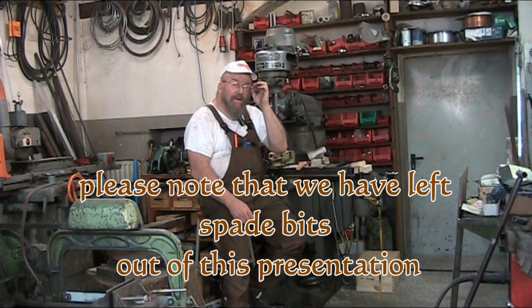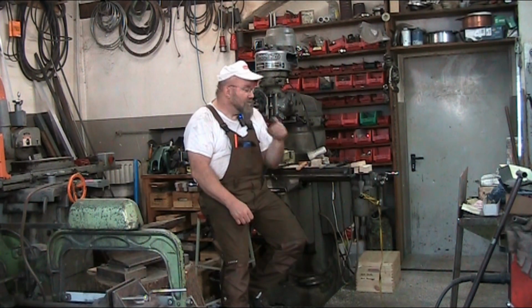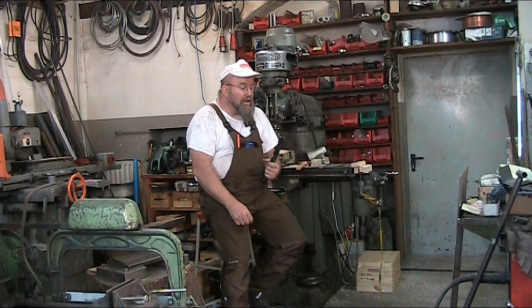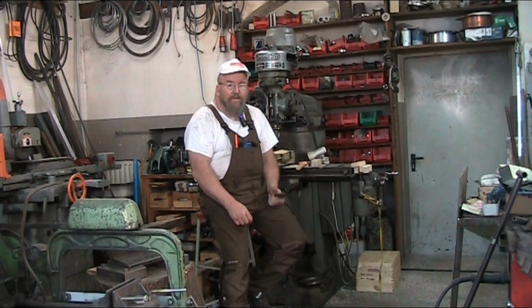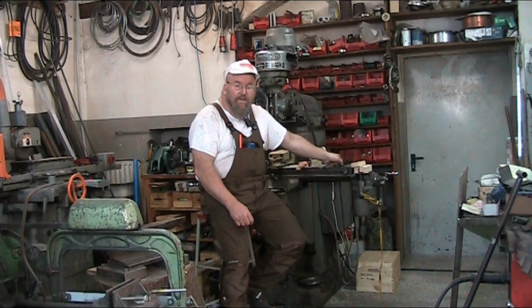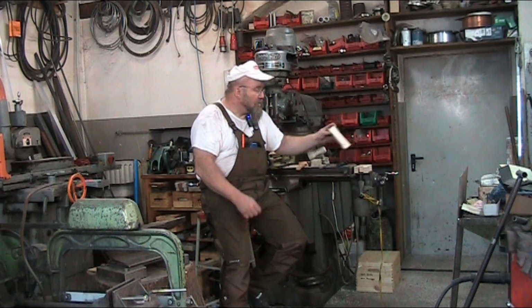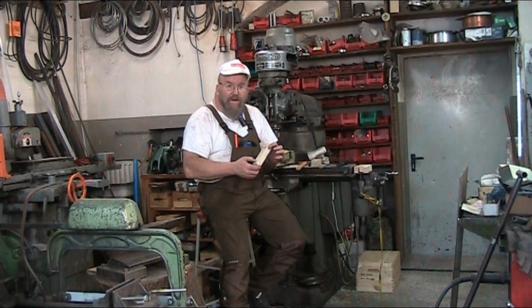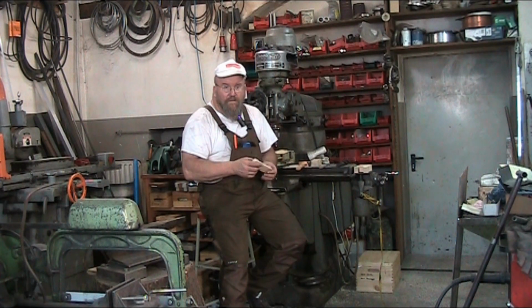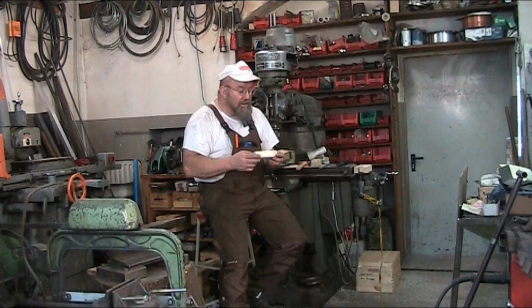Today we're going to be talking about picking your nose, and I'm not talking about this nose, I'm talking about this nose. Now the other day I got to making these parts here for the end matcher, the Marinus end matcher, and I ran into a conundrum where I needed a 5.5 millimeter drill bit for an M5 screw, and unfortunately I didn't have a brad point bit in that size, and I really didn't feel like sending one off to have it ground and yada yada yada. You guys know the drill.